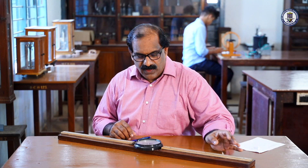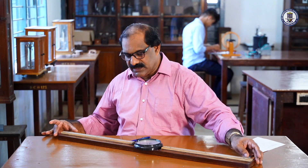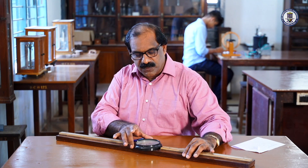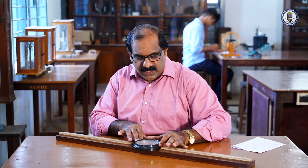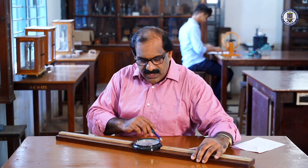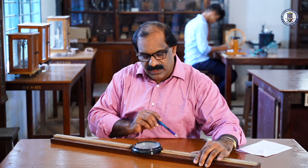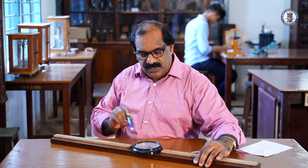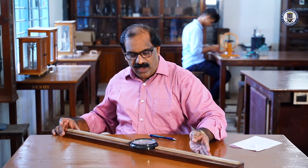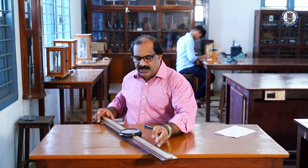To adjust the deflection magnetometer in Tan A position, we have two adjustments. First is the rotation of the compass box: the compass box is rotated so that the 0-0 line is parallel to the scale of the deflection magnetometer. Second, we rotate the whole apparatus so that the aluminum pointer reads 0-0. Once the aluminum pointer reads 0-0, the arms of the deflection magnetometer come along the east-west direction.